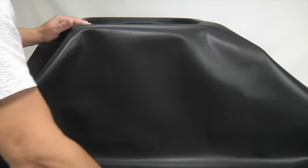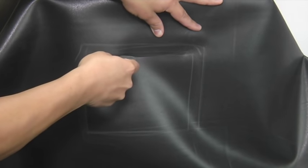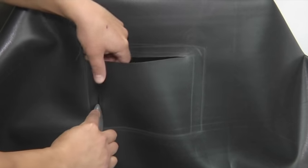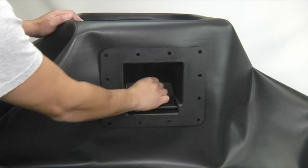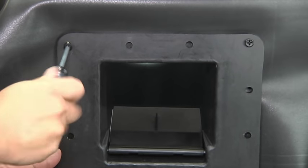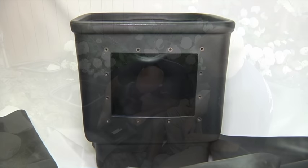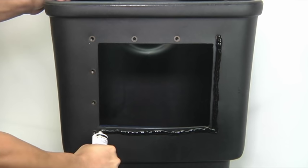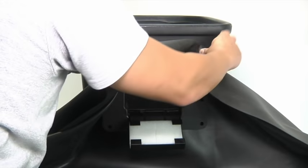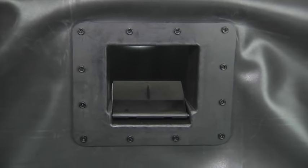Hold the liner up to the face of the skimmer, leaving slack at the bottom, and use your finger or a screwdriver to trace out the skimmer opening. Using the trace line as a guide, cut out the section of liner with a utility knife or pair of scissors one and a half inches inside of the mark. Rounding the corners of the cutout will prevent the liner from wanting to tear when stretched. Insert the skimmer faceplate through the cutout and stretch the liner firmly around the component, making sure that the holes from the skimmer weir door are at the bottom of the component when installed. Temporarily attach the liner to the front of the skimmer by lining up the top corner screws of the faceplate. Unthread the screws and pull back the liner to re-expose the skimmer opening. Wipe down the face of the skimmer and the back side of the liner around the faceplate to remove any dirt or dust. Use a thick bead of silicone over the screw inserts and then permanently reattach it to the skimmer by lining up the previously set screws. Install the four corner screws first and then the rest in any order you choose. Complete the installation by tightening down the screws to form a watertight seal around the skimmer faceplate.